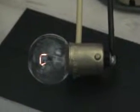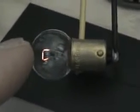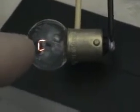This is the continuation of test 5, and you must watch test 5 to understand this test. The bulb, from now on, is going to be a visual indicator of how much energy is going into the circuit. It's not telling us exactly how much energy, but we're going to use it as a reference point. We're always going to keep the bulb at the same intensity, and we're going to study the difference with voltage and frequency.